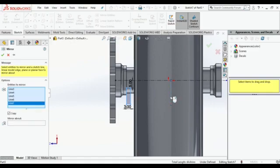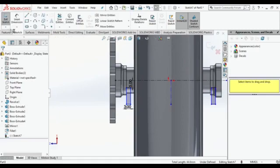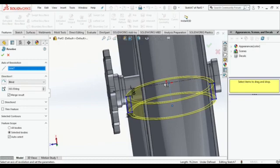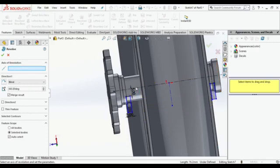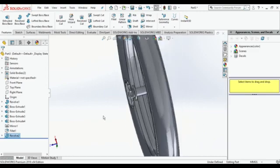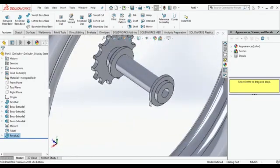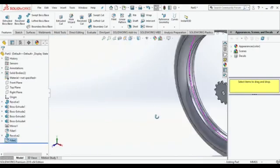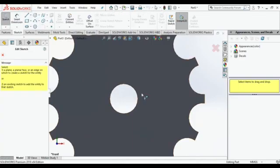So for that we want that, both sides the same. Carefully revolve it. Select the proper line because this is not correct. Yeah, wait for it. I will correct it. Yeah, you need to do it like this and it will be like this. You can see how it is going to revolve. Use revolve boss over here. Then do fillet part. Don't forget to fillet your parts,